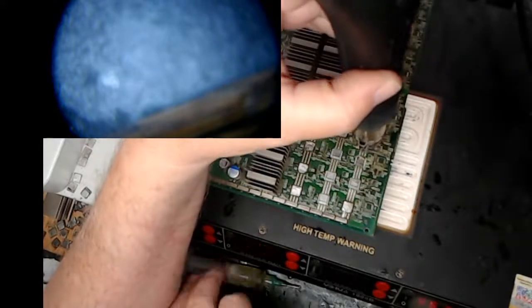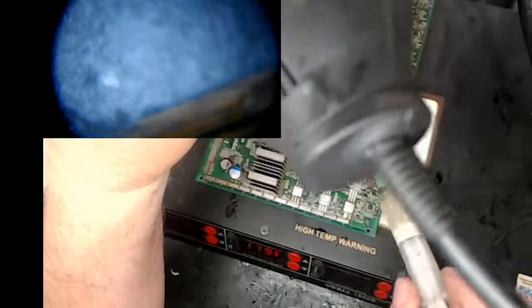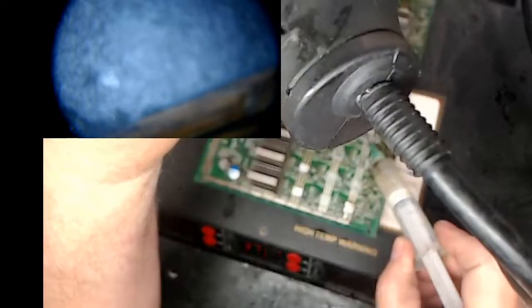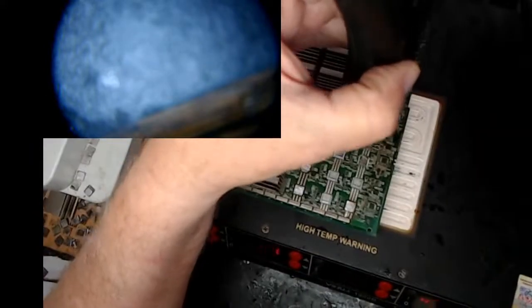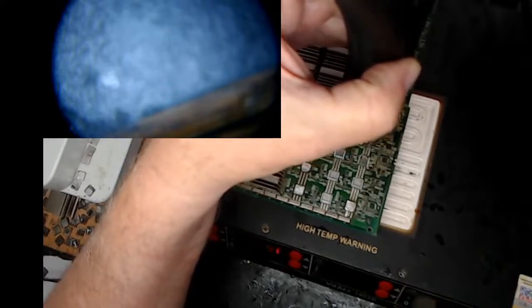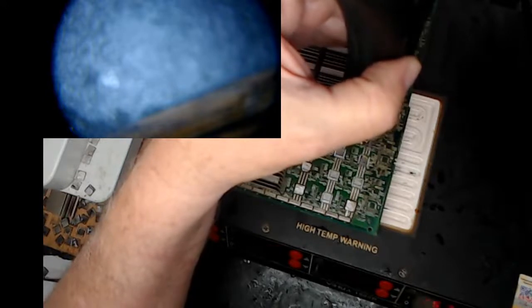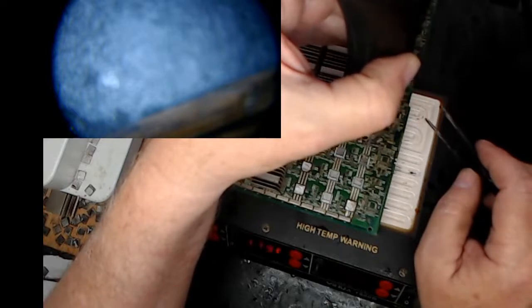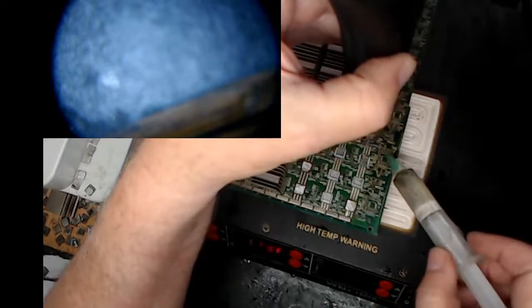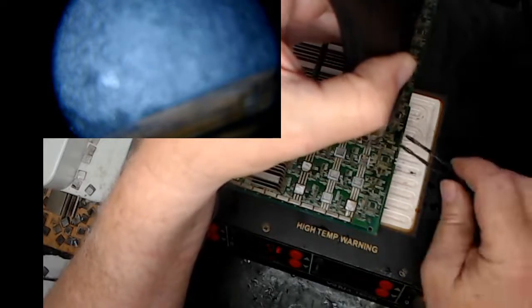Okay. All right. So I've heated this for a while. I think some of the solder has melted. The chip is stationary now. I'm just going to apply some flux around the edge of the chip. I'm going to take the heat on up. Looks pretty good. And sometimes you can't see, so just put a drop there. All right, so this one looks good.